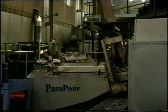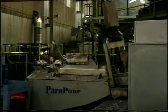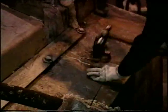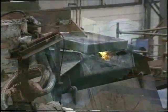It is also possible to have different bodies for different irons. The body is held by wedges, so just knock them out and lift away with a shop crane. The whole body and pour box can be moved as one. If you have a preheated spare, you could be running again in a very short time.